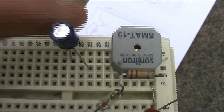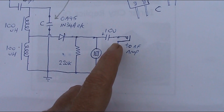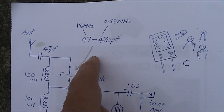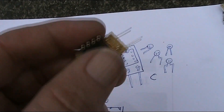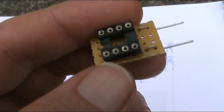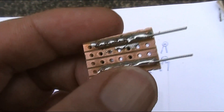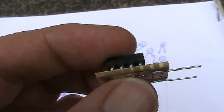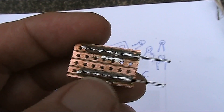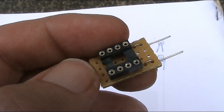Some sort of amplified computer speaker can be connected up to this, but depending on how things are set up you may need this capacitor in series. I haven't yet talked about how I'm going to do the variable capacitor thing given that we're not using a variable capacitor as such. What I'm doing instead is this: it's an 8-pin IC socket mounted on some Vero stripboard. Notice the direction that the strips go — everything on one side is connected to the same strip, all connected in parallel, and same with the other side. So the idea is that you can put in various capacitors in parallel.